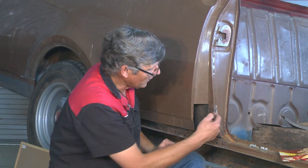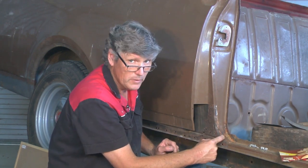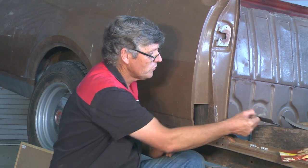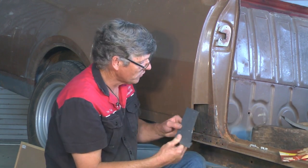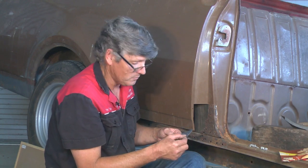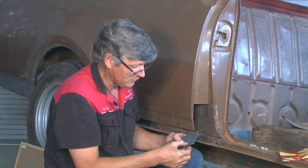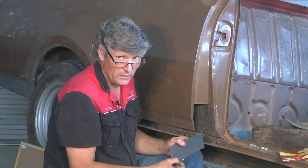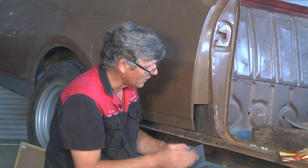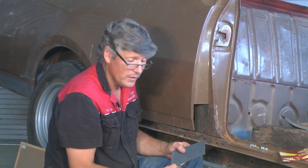Now, because we're going to cut down the front edge and weld down here, work within the capabilities of the piece of material. Normally, a bit of material like this, you can roll around half an inch, usually quite easily. Sometimes you have problems, sometimes you'll get a little lump in the back of it. And in those cases, you come back, you go with 3/8 of an inch, say 10 mil or something like that. But I'm confident on this radius that we're going to fold that around there quite easily.